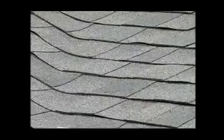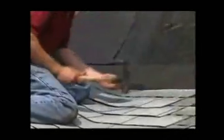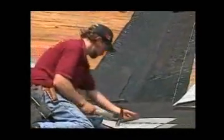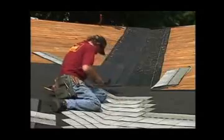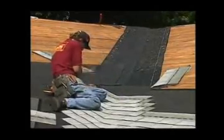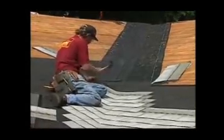Now, apply shingles, assuring that you extend at least 12 inches past the intersecting roof. Don't make a joint in the valley. If a shingle falls short, insert a 1 or 2 tab section or 12 to 18 inches of laminated shingle in the row so that a full shingle extends over the valley. Press the shingles tightly into the valley. Make sure that the shingles lay flat enough so that no bridging occurs.